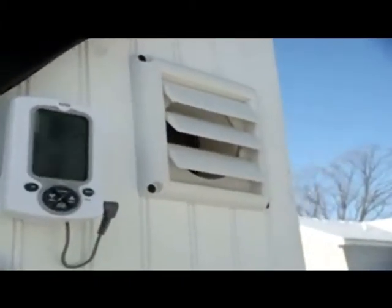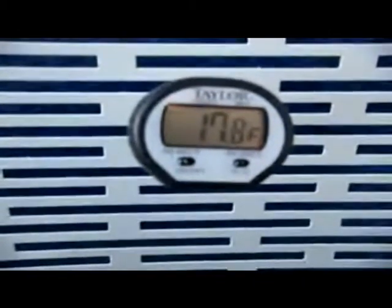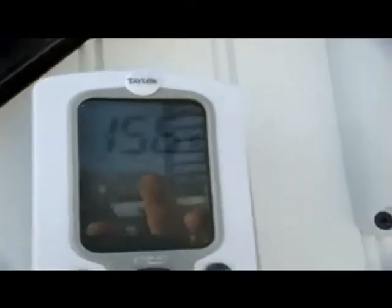There we've got our battery backup, and that kicks on the blower, which draws the air in. Then it starts to blow out. I'm going to show you a full test: we turn the unit on, get a temperature rise, it does a peak temperature, and then comes back down to a sustained temperature. It's at 17.8 degrees going in — and now you can see it climbing. It's up there at 150. We got to 167 earlier today. Really nice air — coming out nice and toasty warm.